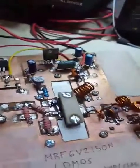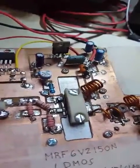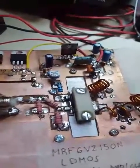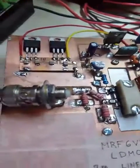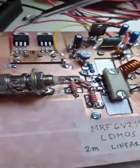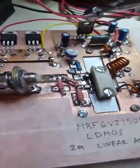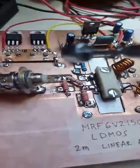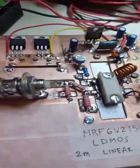For this application the supply voltage is 32 volts, which goes to a cascade of linear regulators: 18 volts down to 12 volts, down to 5 volts, which supplies the bias for the gate. The gate bias has been adjusted for a 2 volt bias.